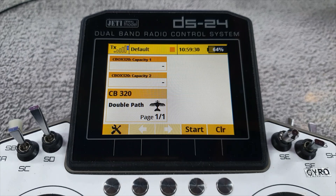Basically, the inputs on the central boxes count the milliamp hours — in other words, the capacity that you've used from the batteries — and they will just keep accumulating this capacity forever until you tell them to reset back to zero. It doesn't matter if you switch the radio off and disconnect the batteries; come back after a year, plug the batteries back in, and it'll still show the last milliamp count.